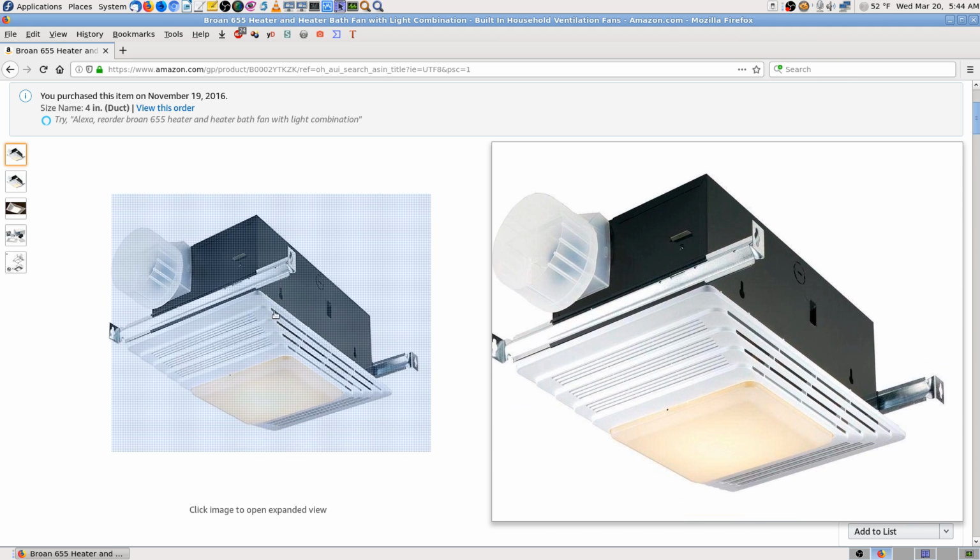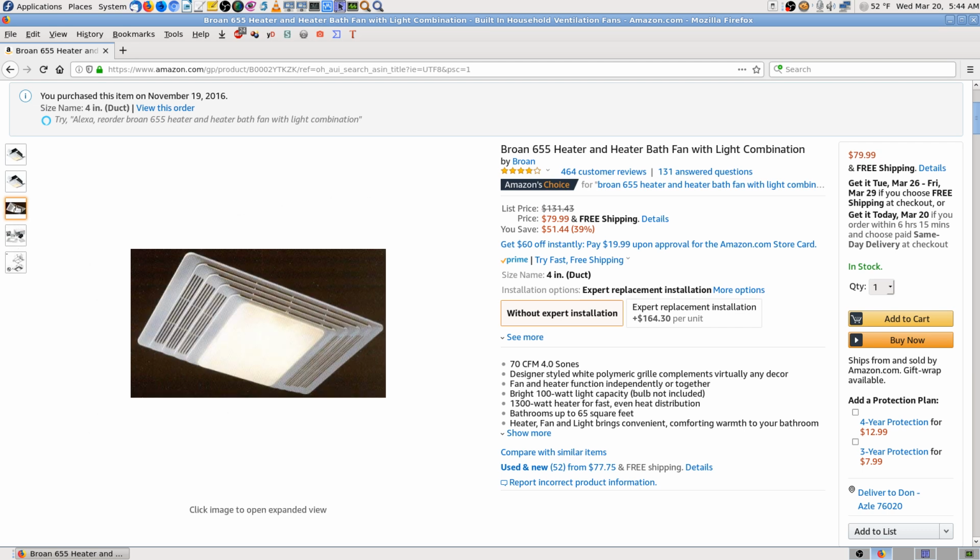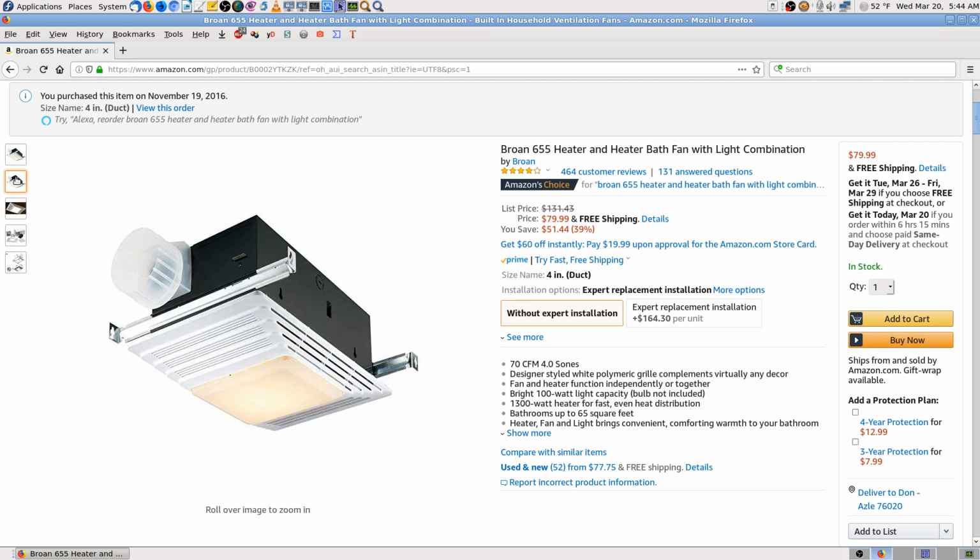and then cut and mark. Of course, you've got to cut and mark your hole. You have the cover off. The best thing to do is get up in the attic and mark it. Now I'm talking about installation. Get up in the attic, have the cover off. You just take the box, leave the cover down in the bathroom, in the house or wherever, and set it down where you're going to need to have it. Maybe even make a small hole through there with a nail or something that can easily be patched. You want to have it look good in the room, is what I'm trying to say. But it has to fit between the rafters, too, to be able to nail it in.